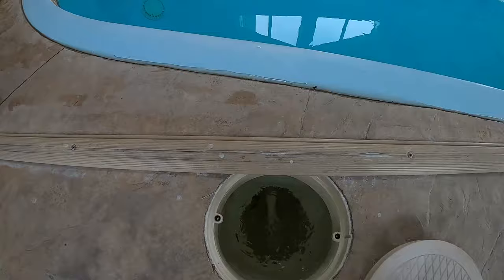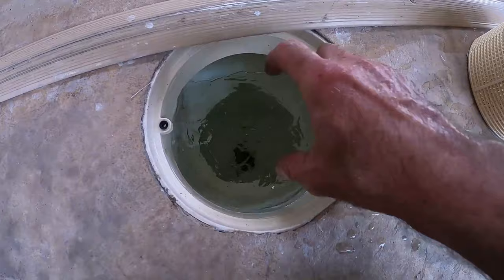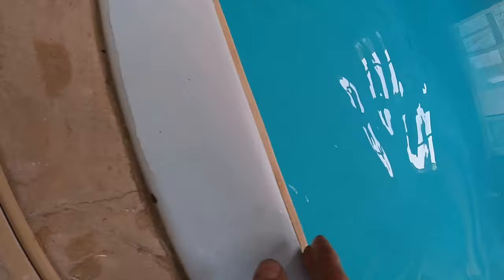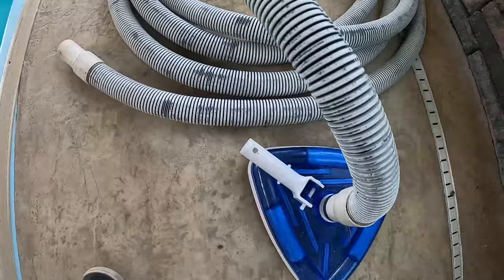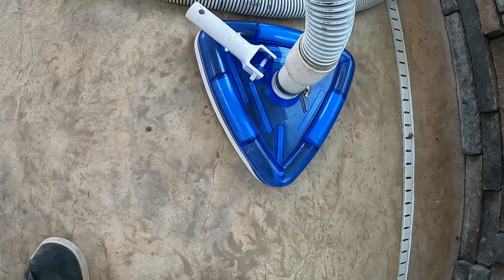We can come out to the pool and our inch-and-a-half vacuum hose is going to go right into the skimmer. This one has one hole in the back and the front hole is plugged up. Most skimmers have two holes and normally one is plugged. If it's not, it leads back to the pool as an equalizer — if water gets below the skimmer plate, it keeps water in the skimmer so your pump doesn't suck dry. Our inch-and-a-half hose end slips right in. I like the clear vacuum head so I can see what's being sucked off the bottom and confirm I still have good suction.